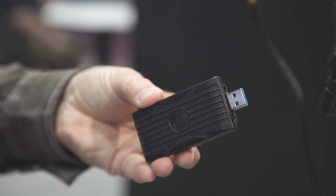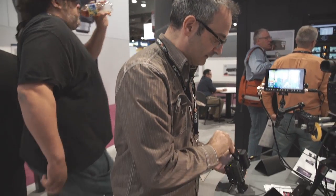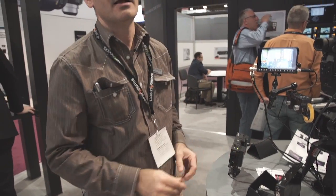Once you've done that, you've got your drive. You just slot it into the back of your Pixi, and when it connects, something pretty amazing happens — the USB 3 converts to SATA automatically. This is a totally unique bit of engineering, and it has allowed us to get really high data rates and the ability to record 4K Apple ProRes 4444 XQ. As soon as you remove the drive after recording, it becomes a USB 3 transfer drive again — about one gigabyte every five seconds.